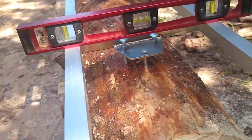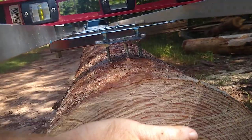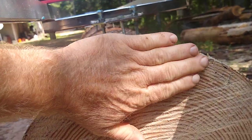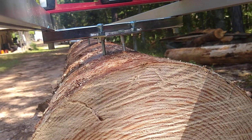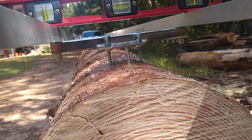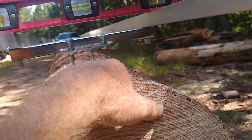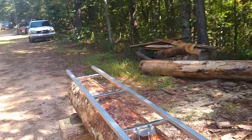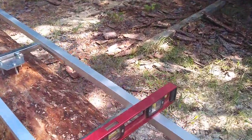When I first started using this system I mounted a piece of angle iron right here, bolted it and screwed it in at both ends — I thought that would be a great system. The only problem is the torque from the screws pulling the angle iron in would actually cause the rails to bow upward in the middle. So that system didn't really work so well.